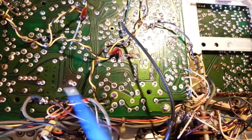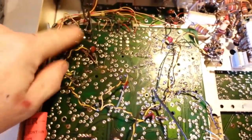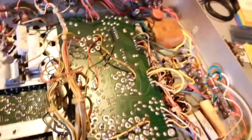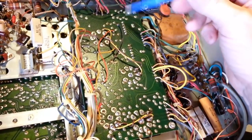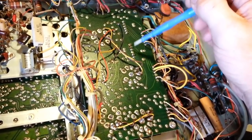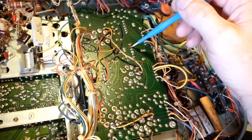Yeah, that looks great. I mean, wow, really nice. Same thing back here, where those other two large resistors are, you'll occasionally see severely scorched circuit board. That looks good. And probably one of the most common places is this board, the BA board right here, resistors right here, and where this small power supply board plugs in on the bottom, you'll get bad connections,